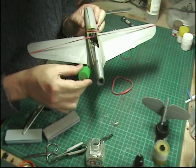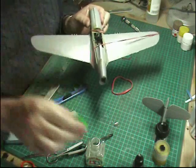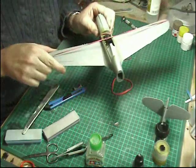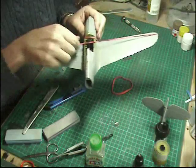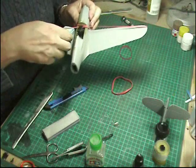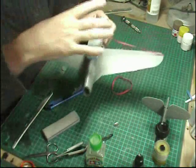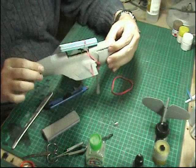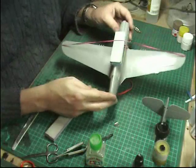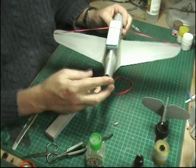If you have got a step then that's obviously where you're going to have problems. You need to keep your pressure up there to lift it up. The other thing you can also do is get your sponge and just stick it on the top — because it's higher it'll lift it up. As you can see it's lifting it up and it's got those joins all together. It's a bit tricky with the light on there but the joins are all sorted out and fine, so that's the last major thing.